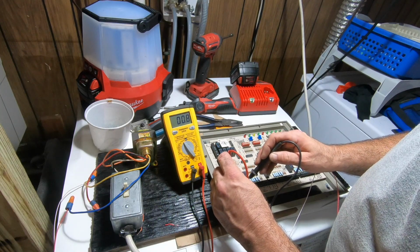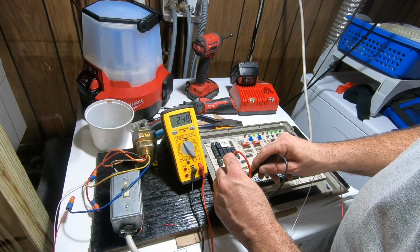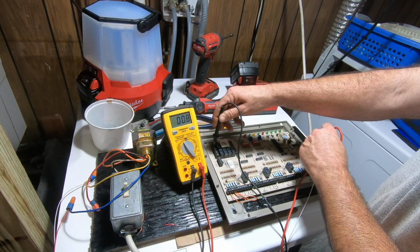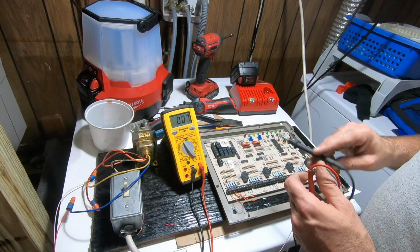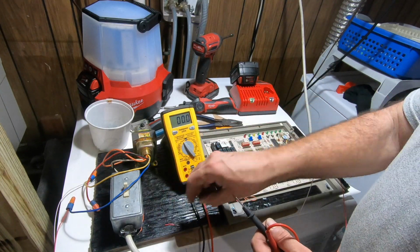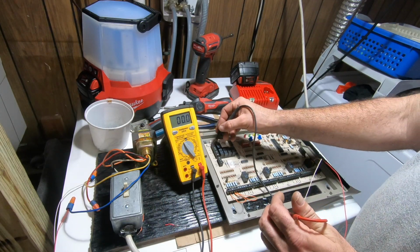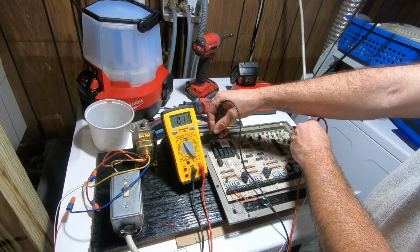And here we should read from. Got power to Y, with power to G. Our thermostat's on. It should be because it's just a jumper, but I'm just starting there. RC to common. We're not getting our 24 volts through. Okay, so RC to common, we're not completing our circuit. We're going to put this back on, because that might be the jumper that's pulled to prevent this from coming up. But we're still not getting power.